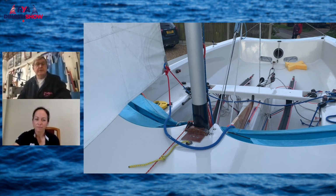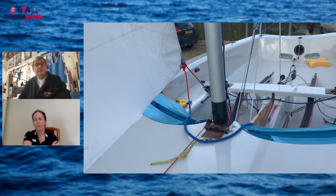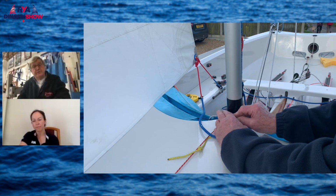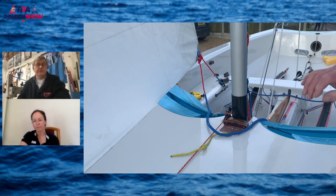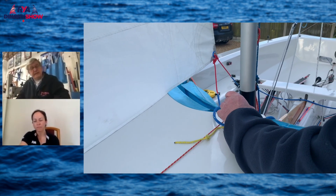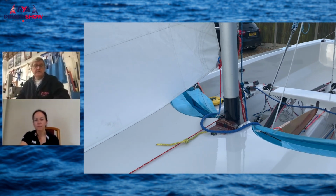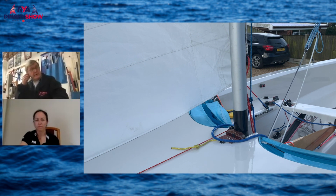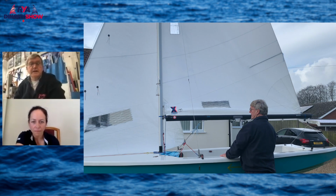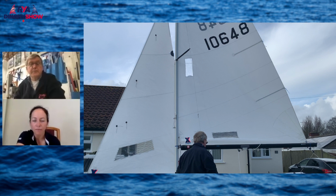Because we're going to control the leech of the mainsail with the kicking strap and the main sheet, we've got to make sure that the mast bends according to what we want. If it overbends, we're going to have a sail too flat and lose power. If it is too stiff, we're going to have too much power, heel over and just go nowhere. Now, in the case of the Wayfarer, we have to use chocks, but it could easily be a mast ram. It could easily be a strut. It's exactly the same principle. So let's see what happens in the case of the Wayfarer when I use the chocks. Right. Can you see there's a couple of marks on the side of the mast gate there?